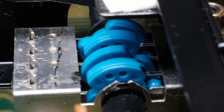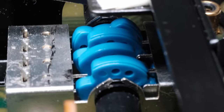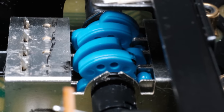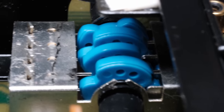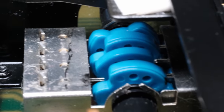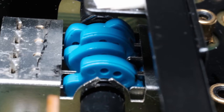I thought they were. When I got the power supply going, I was so excited that I just continued on, right? Well, after I checked it out a little bit closer, I knew I had another issue. And what that issue was, apparently those cams were moved slightly. These cams in these switches, they have to be pretty exact where you position those cams. There's not a lot of wiggle room. You don't need a micrometer, don't get me wrong, but you got to be pretty darn close.